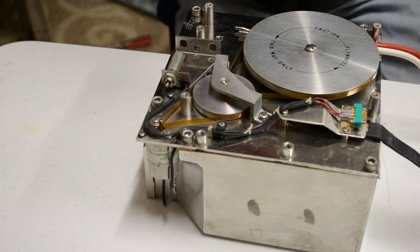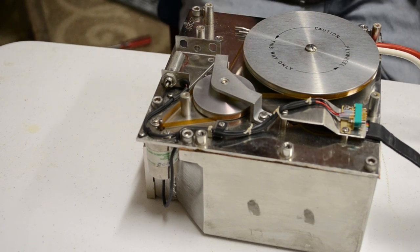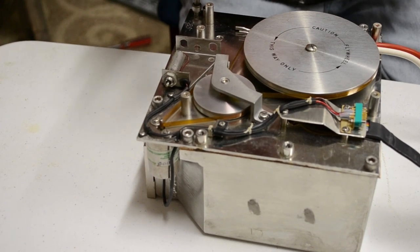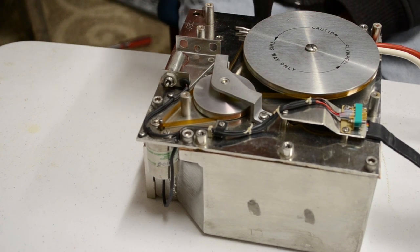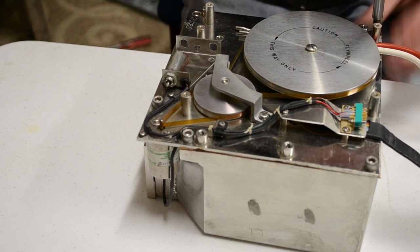Not a problem. There was a fault with the CPU board where in a power blip it would jump back to track one. There were actually a couple of crashes where that had happened, and the investigators found they had nothing to go with because it had track jumped, and they just ended up with an indecipherable mess. Quite a few times the data that's come off these has been corrupt as well.